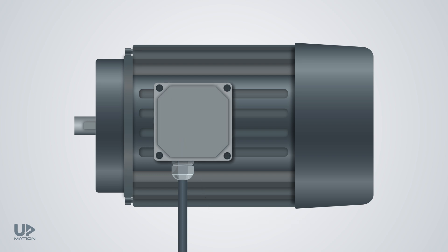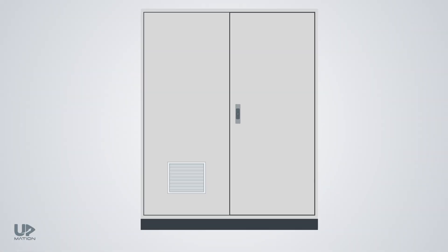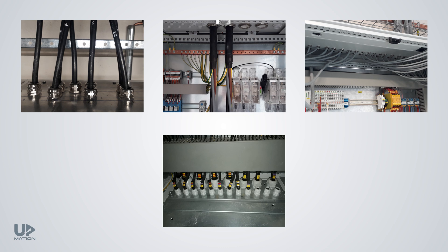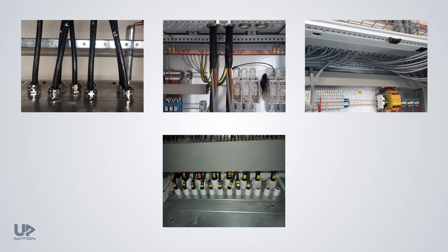In this way, the cable is protected against any possible strain. Moreover, it seals the motor terminal box and prevents entry of water or any kind of liquid. The same procedure applies to electrical panels — after installing the gland on the cable, I pass it through its specific hole on the gland plate, adjust the length of cable needed within the panel, and fix the gland on the gland plate. Cable glands are applicable for all kinds of cables, including power and instrumentation cables.